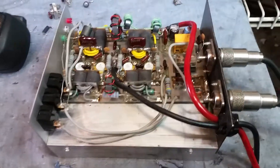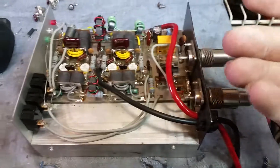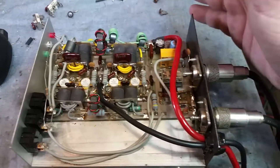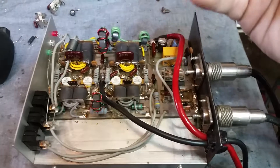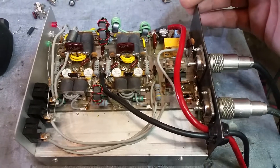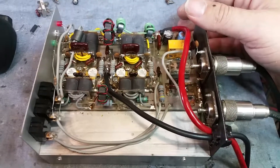The next issue was this amplifier was not set up to operate on sideband — they didn't have enough capacitance on the relay. They only had a 470 microfarad electrolytic on the relay, which wasn't quite enough to keep it latched while talking on sideband. Usually you'd add around 1000 microfarad, but these smaller relays don't need as much. I went ahead and added another 470 in parallel, giving you around 940 microfarads total — close enough to 1000 — and it works great on sideband now.